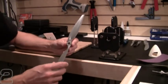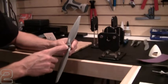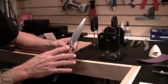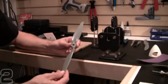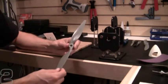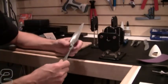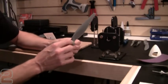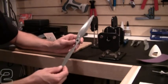The first step before we actually balance the prop is to make sure that the center hole is large enough to fit our prop adapter. It's paramount that you make sure your propeller will mount the prop adapter you have designated before you start balancing, so you know you've got a flight-ready prop. You can literally take it from the balancer and put it on the airplane and start flying, with no modifications that could affect the location of the center hole.